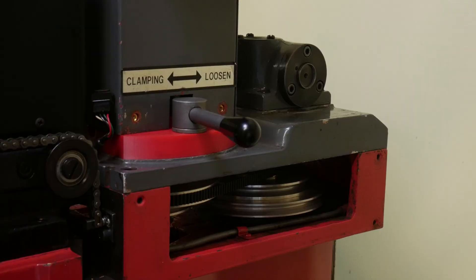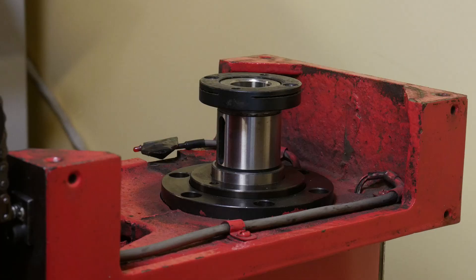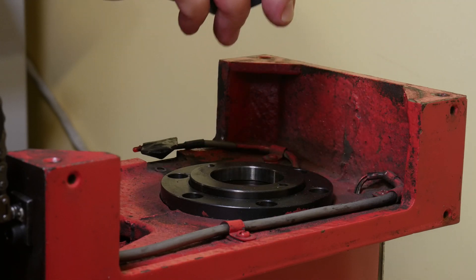So the question becomes: what is actually the inertia of the machine? We tried to do some estimating and calculating, but in the end I just decided that the best way to find out was to pull the spindle and actually measure it. I didn't want to take the head off the machine again to press the spindle out. I decided to just whack it with a mallet. I actually discovered, just a little bit too late, that there is a way of pushing that spindle out with hydraulic pressure — it's actually built into the spindle — and if we ever have to pull it again, we'll try doing it that way.